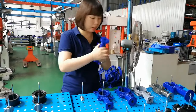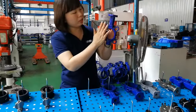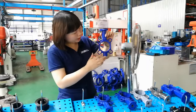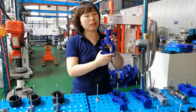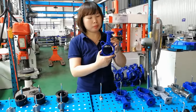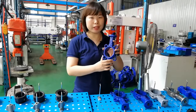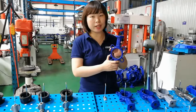The ductile iron elongation is double that of cast iron material. The flange of our butterfly valve body is our patent body — the side flange connection complies with all standards such as British standard, Chinese standard, Russian standard, European standard PN10 and PN16, American standard ASME Class 150 and 125, and Japanese standard JIS 10K and 5K.